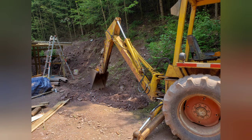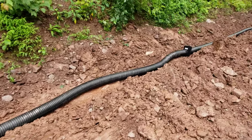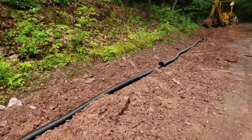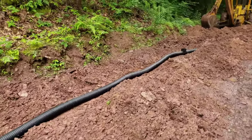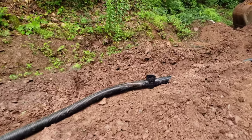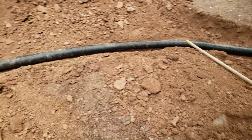Then I started to dig a ditch and had a hose blow out — that was fun. But got the ditch dug, got the drain pipe installed with the drainage basins spread out throughout the yard. I already had pretty good drainage, I just wanted a little bit extra. I ran about 130 feet of pipe all the way out to the end of my yard and it goes out over the bank, which is about where I wanted it.